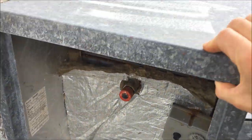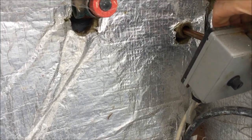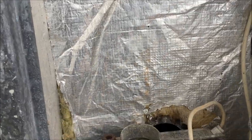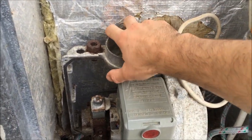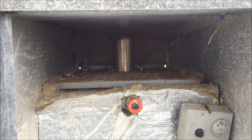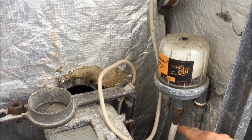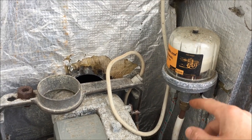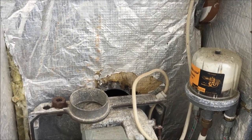Having a quick look around inside with the left hand side panel off — up here is the thermostat, which just slides in and out, behind that little copper pipe there. This is the burner unit down here that burns the oil and throws the heat through this hole into the heat exchanger, which is a set of pipes inside that metal box. You can just see that stainless steel chimney coming up on top. This thing here is a tiger loop — instead of having an oil pipe going to and from the oil tank, it puts it into this little bottle here and takes it from that.